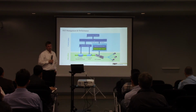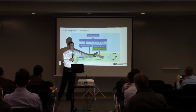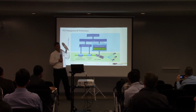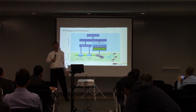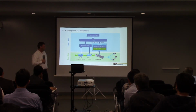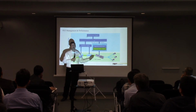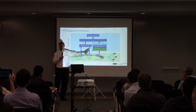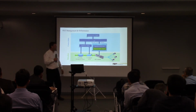So now to wrap this up into VOLTHA, we're sitting here architecturally, like I've described, in the network, hosted in a layer 2 switch in a CORD environment. You're then directly tied into that switch environment. So if you're doing service provisioning across this, it's a natural fit in that we're an element of the switch. We're a port. In fact, some of the requirements we get inside and outside of VOLTHA is as much as possible to make this PON port just look like an extension of an Ethernet port. So you're effectively going from an NNI to multiple UNIs and running flows through that, which is the design of VOLTHA. But the fact that we're actually hosted directly on a switch, in a common element switch, you're doing port provisioning across the whole network that way.